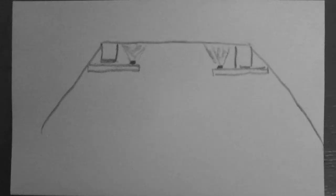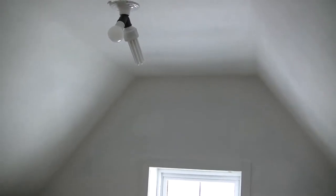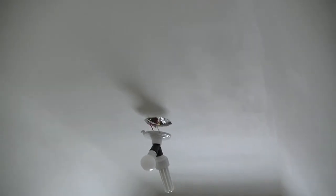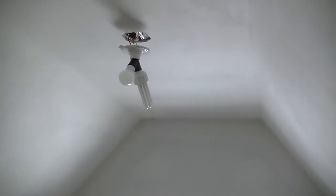Once the room is empty, my plan was to frame the ceiling, attach drywall underneath as a lower ceiling, install cove lighting with LED tape so that it shines up on the upper ceiling, and add a faux tin ceiling treatment to give it a more sophisticated look. The first step will be to get everything out of here, and then start measuring to put up the framing, which in this case is 2x4 ripped to 2.5 inches.